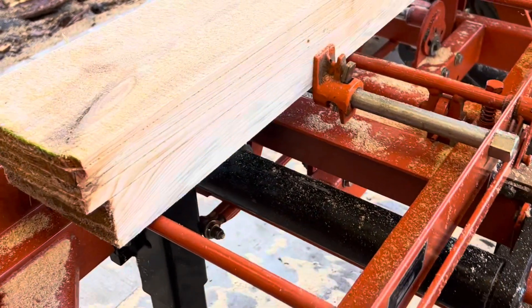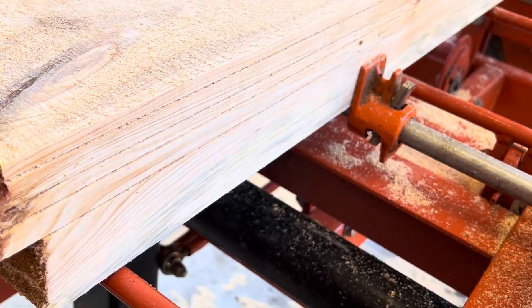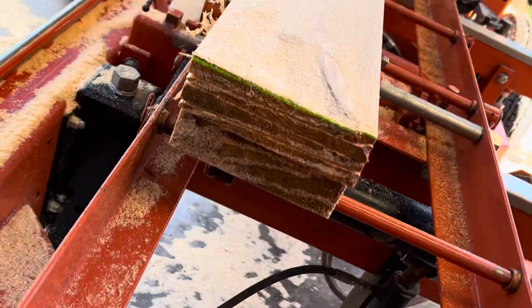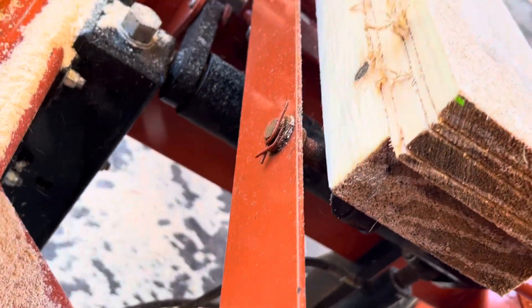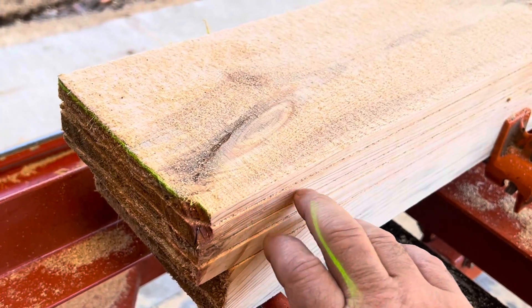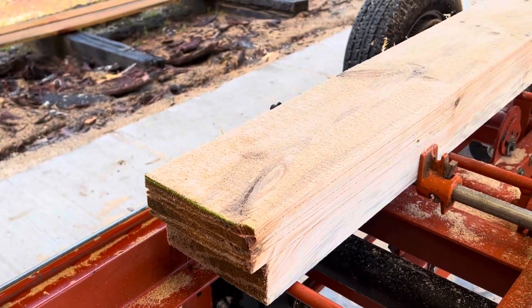One last thing: I've got an MP100 planer, so what I did is I planed this side here — I did it on both sides, planed both sides. What you'll find is this clapboard's edge that lays is straight as an arrow, which is kind of nice. So when I go to lay those things, I've got a nice flat edge.